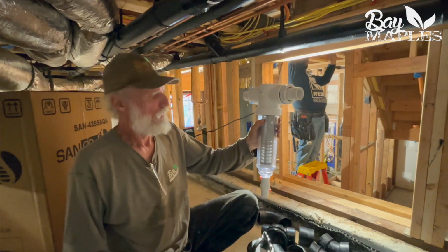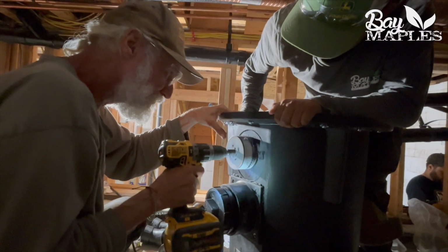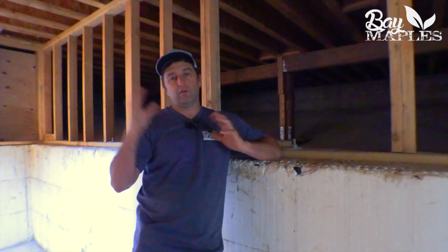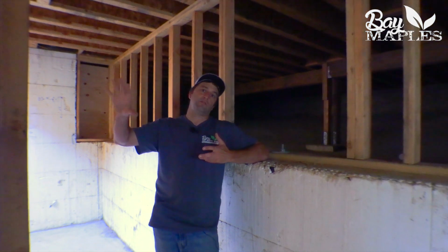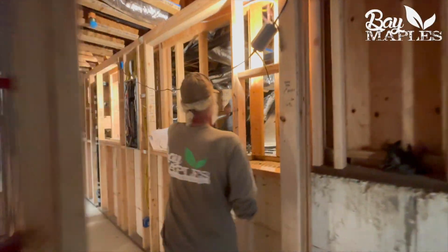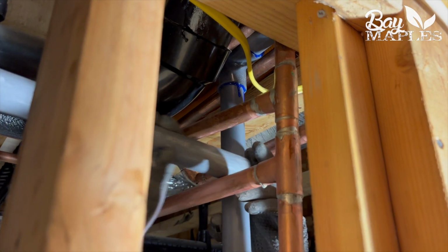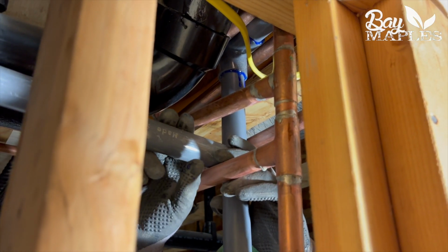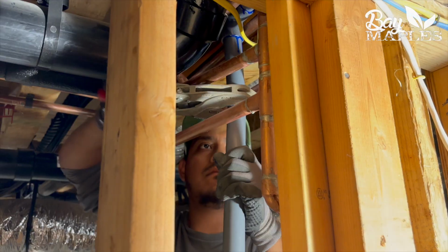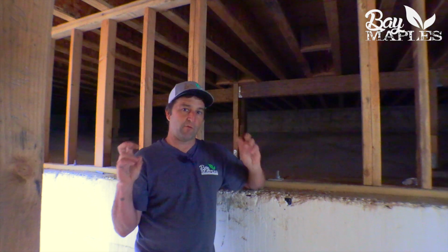The filter system is the only thing that's really in addition to this. All the other plumbing stuff, the cost is basically the same as a traditional system, but the filter is the one sort of additional thing. And so even if you don't want to pay for that additional filtration system at this point in time, you can at least put the plumbing in now and basically have stub outs for the filter at a later date. And that could happen 6 months, a year, 2 years, 5 years, 10 years down the road. But all of this part under the house will be in place and basically making your home gray water ready.